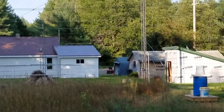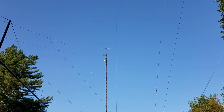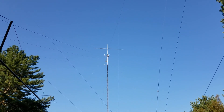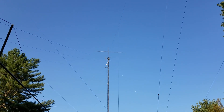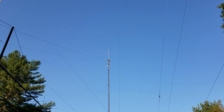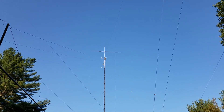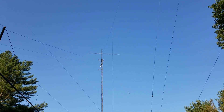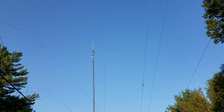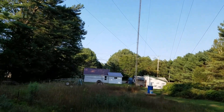That's how this system works. It may seem like a lot of trouble for a small VHF antenna, but I think this works better than pulling them straight up. When I put this 432 megahertz Yagi up there I actually bent an element and didn't notice it until I had it all the way up the tower. Then I was up on top of the tower for about an hour and a half trying to poke out with a long aluminum pole and straighten the element. This approach avoids any of that — so far it's avoided any bent elements.